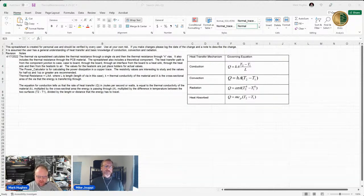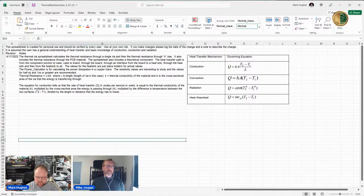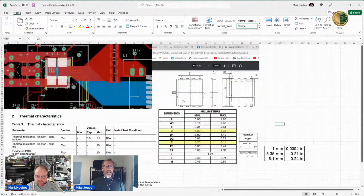Let's go over to the page with Sven's design. So 60 watts — is that all from ohmic heating inside the components or is part of that generated in the traces too? It's just the component. And one of the things I brought up with Sven was that he also needs to consider the losses in the conductors.